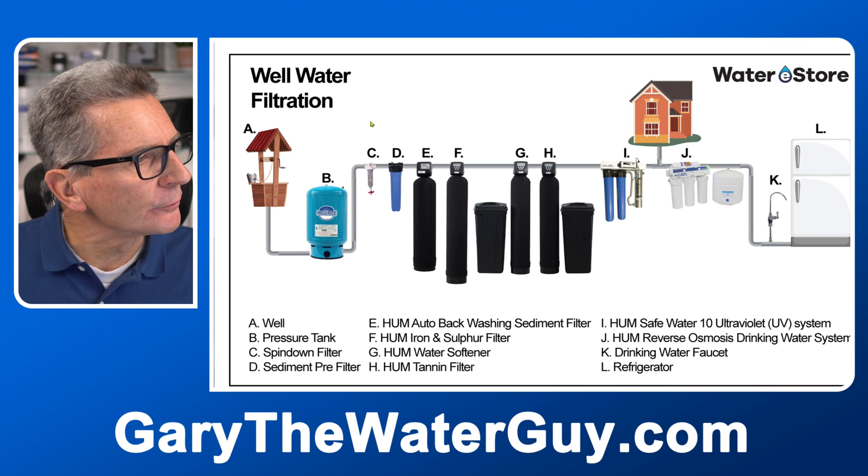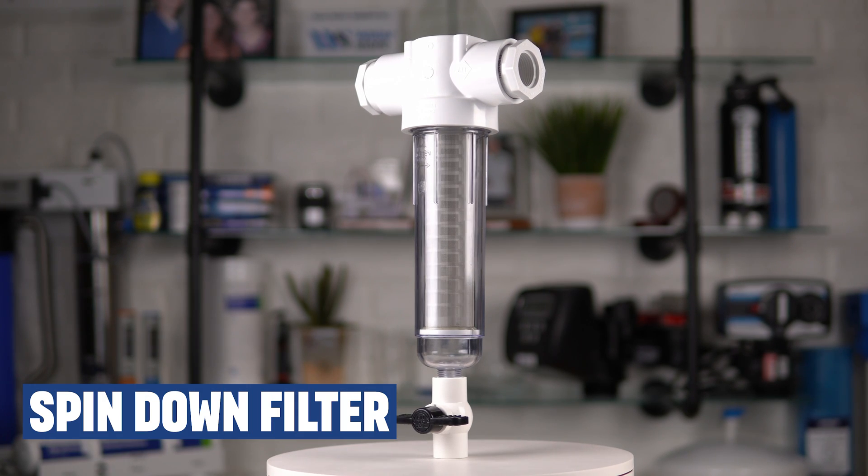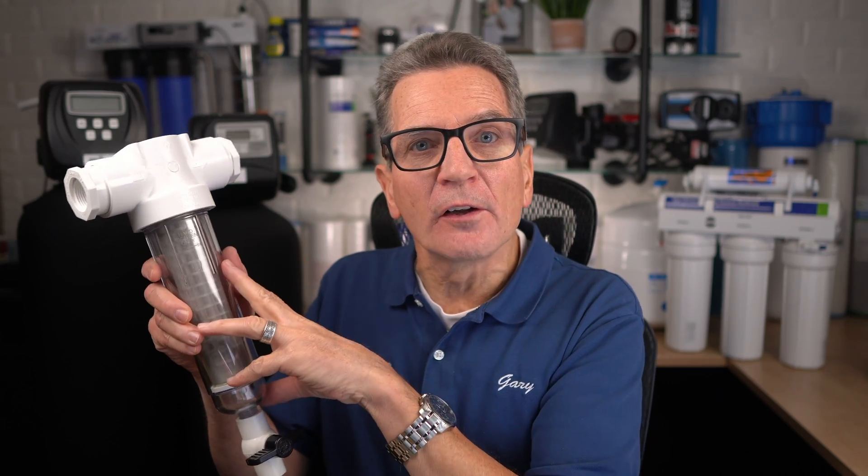Next you would use one or sometimes more of these sediment pre-filtration systems depending on how much dirt there is in your water. You can see a spin-down filter right after the pressure tank. A spin-down filter is used for very coarse filtration. As water flows in, dirt accumulates on the filter element inside. After a few days of use you need to flush it out — just put a bucket underneath, open the valve at the bottom, and centrifugal force will spin the dirt out. Then shut the valve and go on for a few more days.